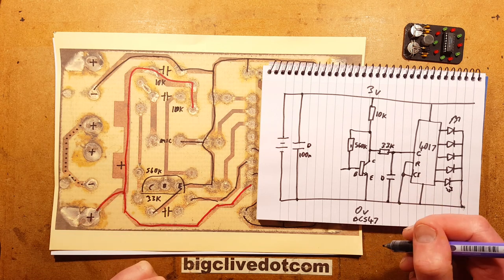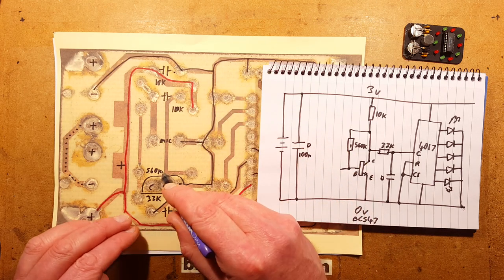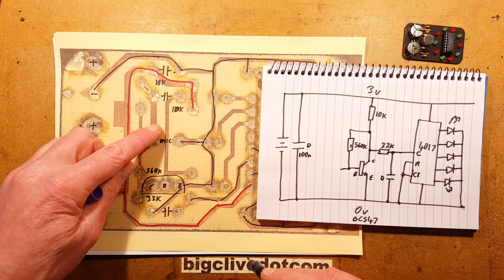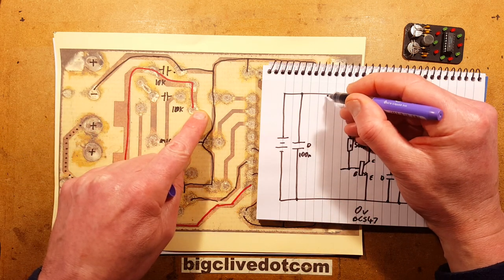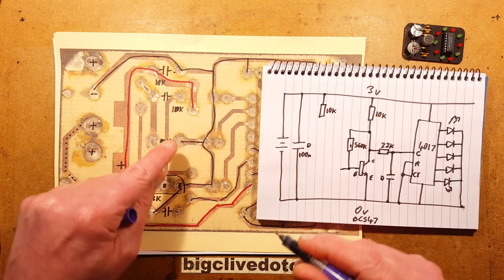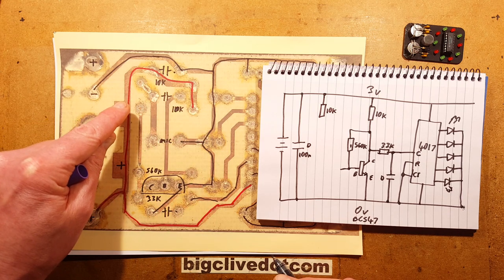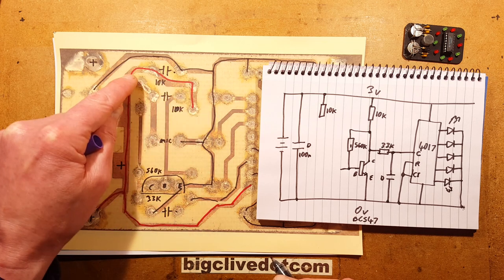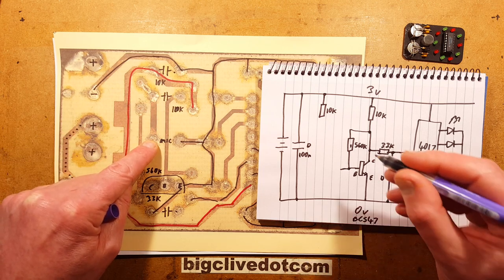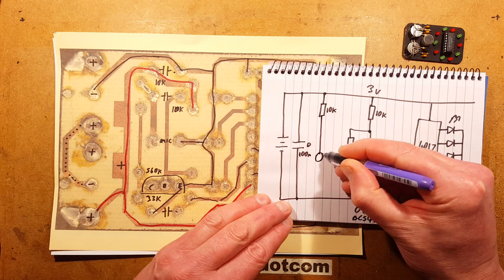Okay, now let's look at the audio circuitry. So I've accounted for that component, that component, that component, that component. I've got a 10k resistor and a capacitor to account for. The 10k resistor is connected to the positive rail. That's the wrong 10k resistor. The 10k is going to the microphone, which is then connected to the negative rail. So, microphone...